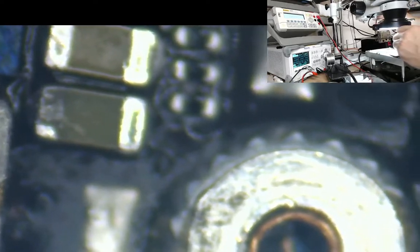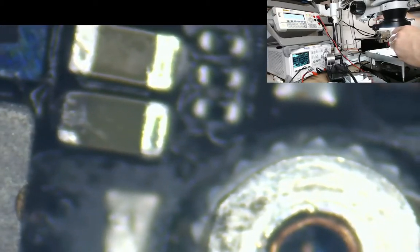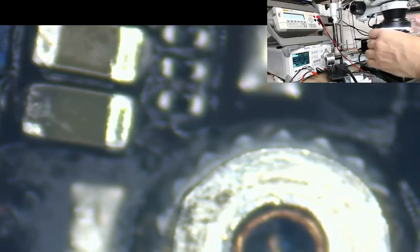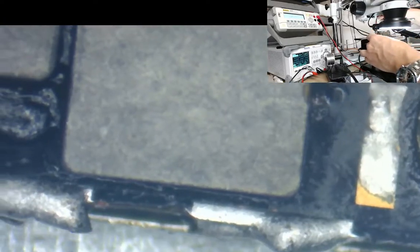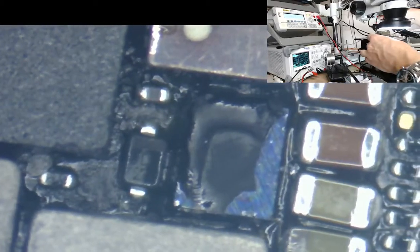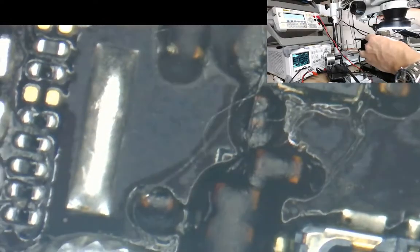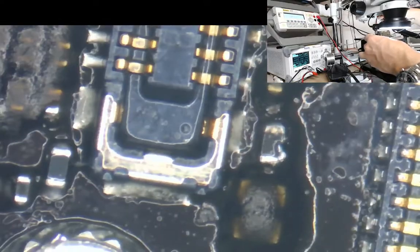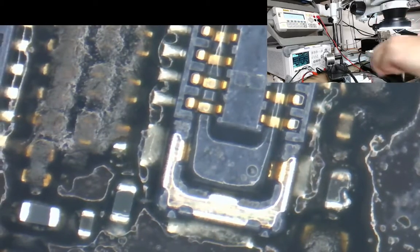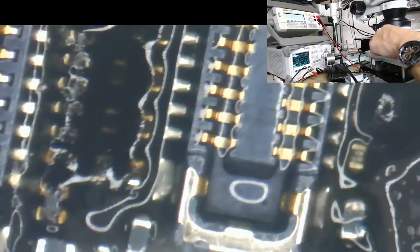Do you know, I thought there was long screw damage on this board then. I was about to just go, ah! So, instead of us having some jumpers everywhere, we now have a backlight coil. We have the diode where it's supposed to be. We have 3 caps where they're supposed to be, instead of one over here. And we have the backlight filter as it should be, right? So that is how you're supposed to do this repair.